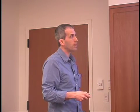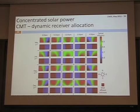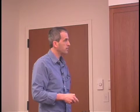However, if we also allow an aperture to the south, we can use this field, and sometimes during the day, or throughout the year, this heliostat will be most efficient. So we also check this ability. And here you can see how the sun changes the efficiency here in the center. On June 21st, the sun is just above us, at about latitude 30, so you can see these are most efficient. The heliostats closest to the receiver are the most efficient ones. And this is what we did.